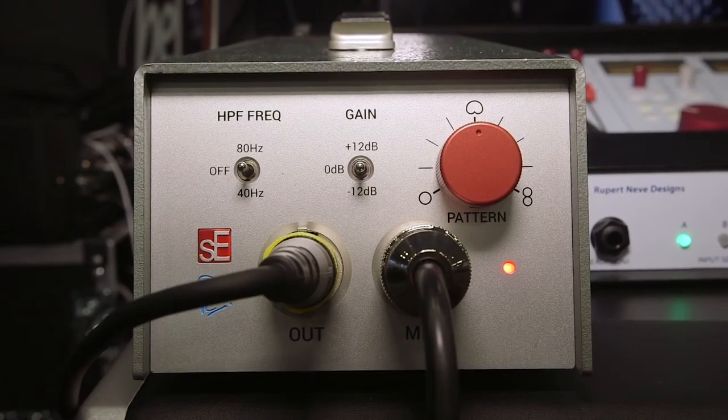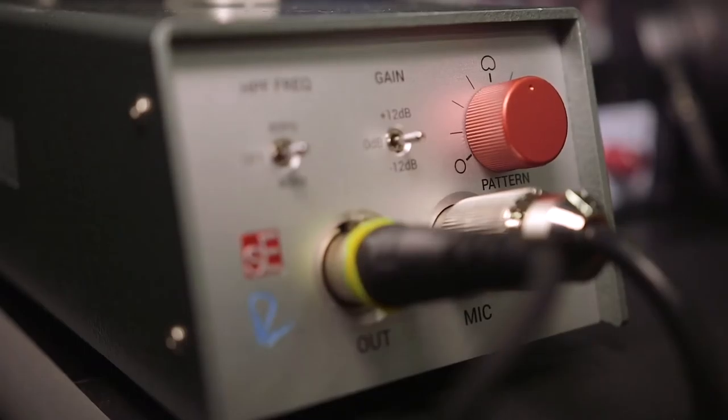Some of the more unique features of the microphone are that, because it's Rupert Neve, we have no pad between the microphone and the electronics itself — we have a nice direct coupling. What makes this special is a very wonderful power unit, the floor box, which has literally the output drive and section from a 5088.